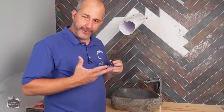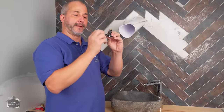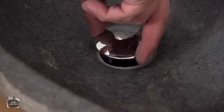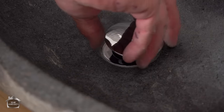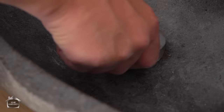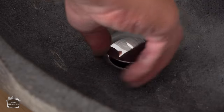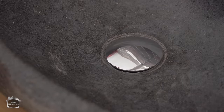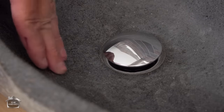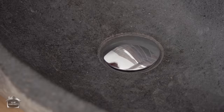Okay. Now for the drain stopper, this threads into the bottom of the drain and it's a clicker. Okay, has this little flange gasket here. So you just set it over top. Again, go counterclockwise until you feel it sitting in there. Right, that's the spot. And then thread it in. Okay, and then we have a drain. The danger of this in this type of bowl is because there's no overflow. If you do this and fill it, don't leave the room.